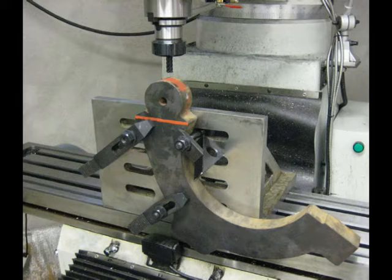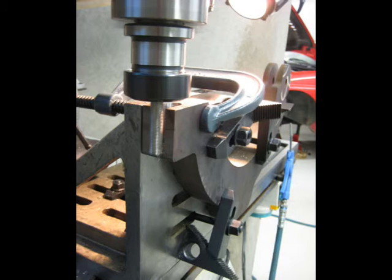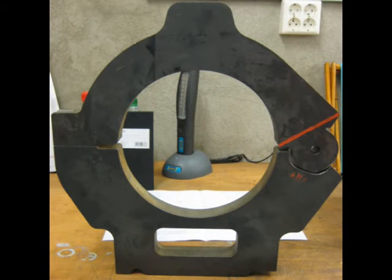In these pictures here I'm making the first mistake — the first cut of the whole project. The slot I am cutting here should have been in the upper part of the steadrest, not the lower part. I didn't notice this mistake until I was drilling the holes for the finger holders in the lower part, and then I realized the holes would interfere with the cutout. I'm cutting the slot for the clamping bolt. These are the two pieces cut, wrongly put together.